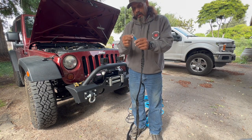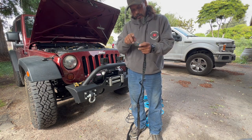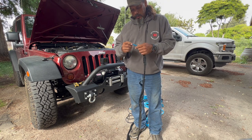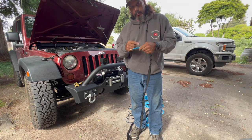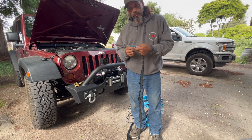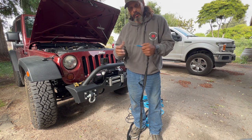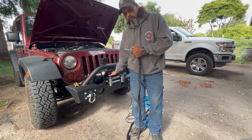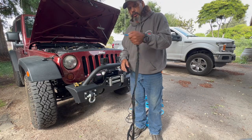On their ropes they have this little eyelet thimble — or something like that. I'll show you what you've got to do to make this work. It's pretty straightforward. What we're going to do is put some tape over this end just to hold it, cut the thimble off, and basically fish the rope back through that hole, set the set screw back in, and that should be it. The line pressure from the wraps on the drum is enough to keep it on there.